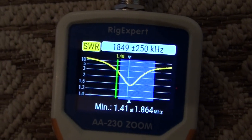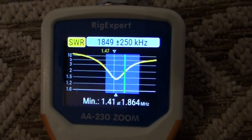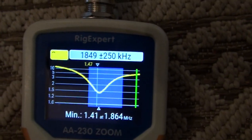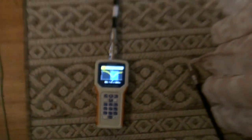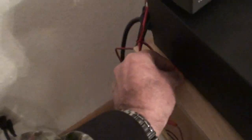Isn't that weird? So when I trimmed this antenna, there was a whole lot of back and forth — cutting the length, two inches on, four inches off, screwing up, having to solder the wire back on, wrapping it around. That's an all-day job. Apparently I did it when I had this electronic tuner powered up, because I was pretty happy with those figures, not realizing that there was an interaction thing going on. So I'm not sure what to do. When I disconnect that, that antenna is just a parasitic wire — it's not active, not tuned, it's just a big loop, probably open.